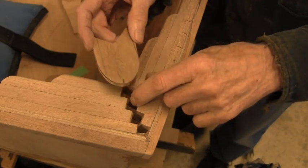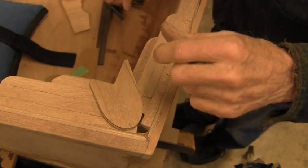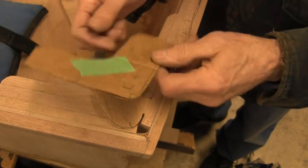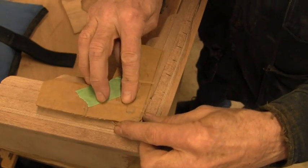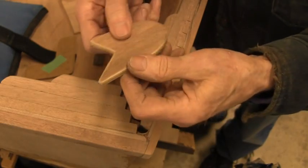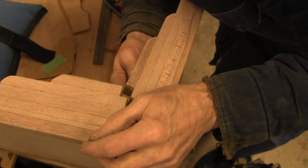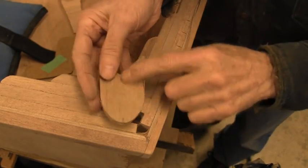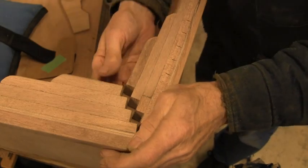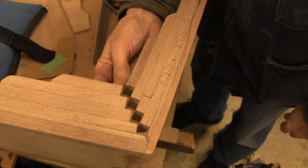I mean, these holes will come in, but the EZ-Fillet will go down and epoxy to it too here. So I've got another one made on the other side. And basically I just took this and laid it down on a piece of plywood and then shaped the corner like that. And then I've already got it pre-beveled, rounded over, sanded on the bottom. I think I might gel magic in this side. I've got a good contact here, and I can puddle up some over here. So I think it'll work. So let me go ahead and do that, and then we'll come back after I get those in place, and we'll start drilling some holes around the edges for the screws.